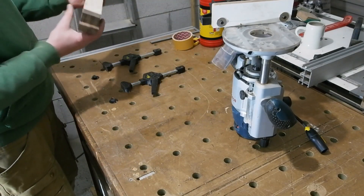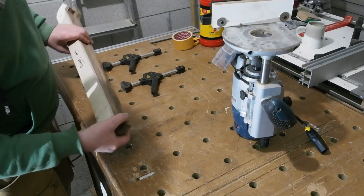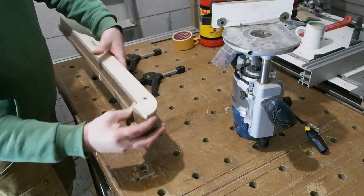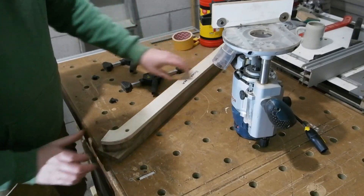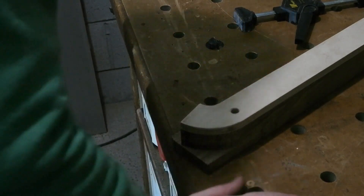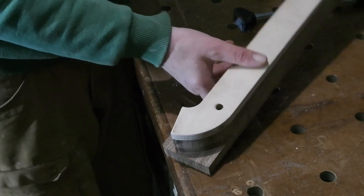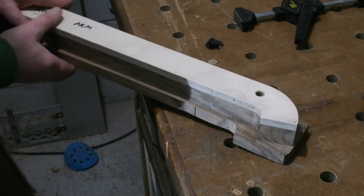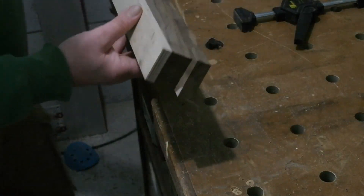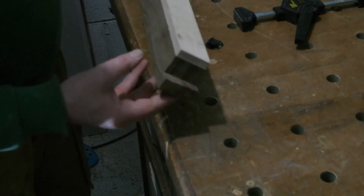There we are — a little outrigger to balance the router. I've cut myself three different sizes for the different size stock I cut for my furniture, but you could cut an outrigger for any height really, just no less than the fence itself sits below the router base, obviously. One of those things that's got me wondering why I didn't make this a habit a long long time ago. Oh well, better late than never. Hope you found this pretty quick and easy tip useful — please like and subscribe for more like this. Comments and questions welcome below, and as always, if you've made it this far, thanks for watching.